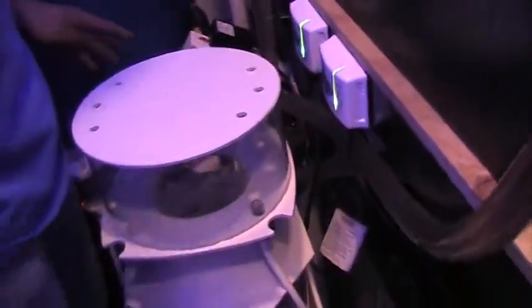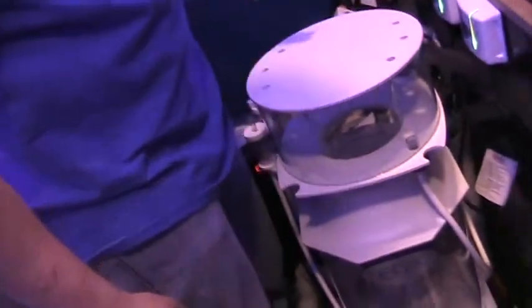This tube right here. Now this tube, you gotta be very careful to make sure that it's not going down and it has no restriction. So we did not reduce the size of the PVC, and it's not going up at all. It's going straight back into the sump. That's why the Deltec is sitting on the bucket, to make sure that the exit tube is securely in place. And that's all nicely glued together.